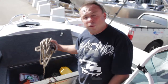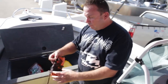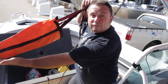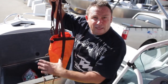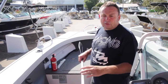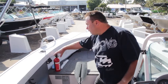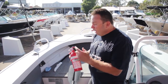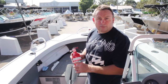We've got a spare piece of rope, a spare anchor, and a nice first aid kit. We even have a drogue - if we were broken down, it would slow down our rate of drift. It's another form of anchor; certainly won't hold you in the one spot but will slow down the rate of drift. The last couple of items are a paddle - good idea to have one. In this size boat a little bit hard to paddle anywhere, but you could certainly fend off rocks, oysters, and anything that might cause damage. This boat's also got a fire extinguisher - the white band, powder type for fuel, oil, and electrical fires is the requirement, but only if the boat's over five metres. This is only a 4.7 metre boat, so it's not really a requirement.